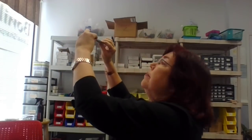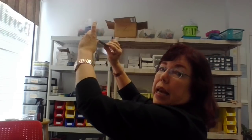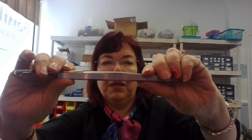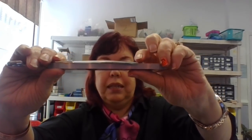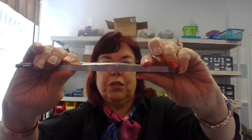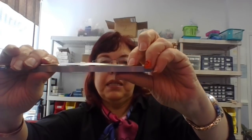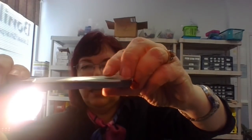When I get that on the bar, and you can obviously see how bad that is, I would take it up to the light, and you see I'm holding it against the window here, and I'd squeeze. As I squeeze, if it's in alignment, that curvature of the blade, that is correct, you're supposed to have some light underneath there, should flatten out altogether and you shouldn't see any light. If you have a place where you're seeing light, then you know you have a problem. Now this one I have a really bad problem, because the minor ones I didn't think you could see on the video. But this one I have a really bad problem, and you can see, I'm going to put it right here. Do you see the light between it? You see it touches, and then that tip comes up again. Now if I were to squeeze back here, that gap's not going anywhere, and that tip is up in the air. Let me put this light here, maybe you can see a little bit better. But as I said, this is a huge exaggeration.